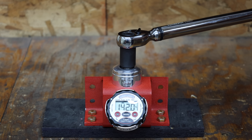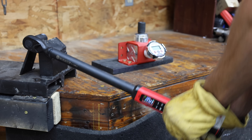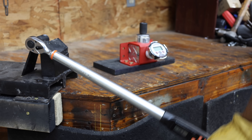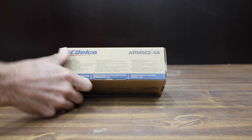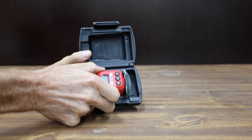In the first test, I'll measure the torque accuracy at 50, 150, and 250 foot-pounds. I'll then cycle each torque wrench 1,000 times, and then we'll test them once again to see which ones are the most accurate. In addition to testing the torque wrenches, let's also test this torque adapter, which is made by ACDelco and costs $64.